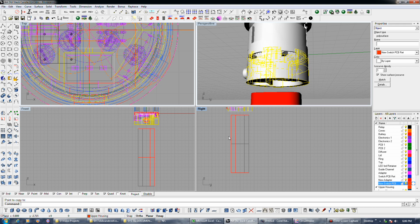So, basically it's going to flare out and go down, but I got to add thickness, and that's another reason to add some generous clearances in here as well. But it's going to have to get thicker for these threads in all likelihood. Because, like I said, I want to add at least an eighth of an inch into the diameter of this inner part of this tube just to begin with, just for battery clearances.